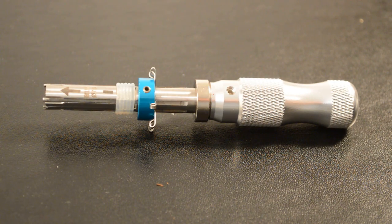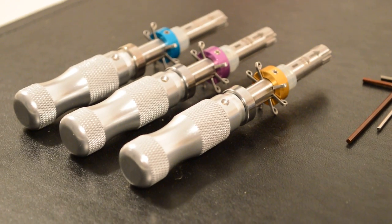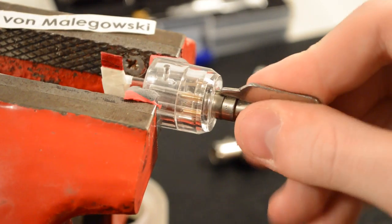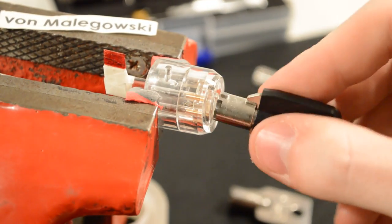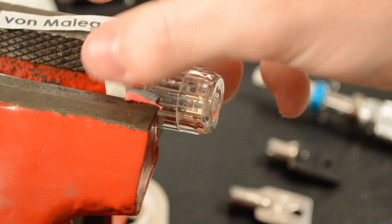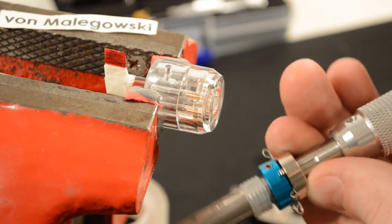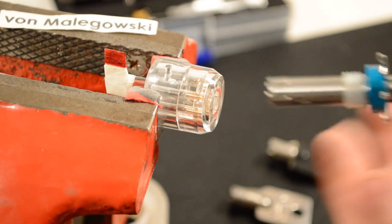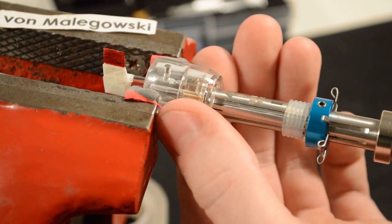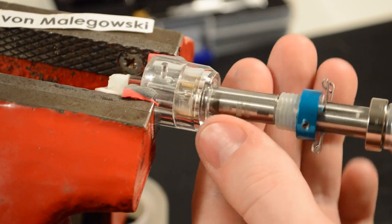Now that the tubular lockpick is calibrated, you can pick the lock. To do this, place the pick into the lock, making sure to evenly apply pressure. Insert the pick into the lock slowly, allowing the picking needles to map to the corresponding pin stacks. Slowly apply left to right turning torque to the pick, and the lock should open.